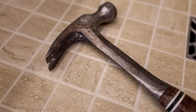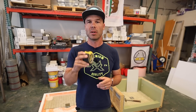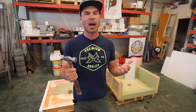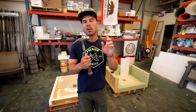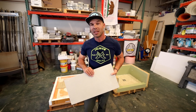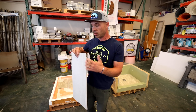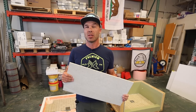I'm going to be doing drop testing on the foam pan and the mud pan. First, I want to test dropping a heavy tape measure — a 25 or 30 footer is pretty heavy and can pack a punch. Next is a hammer. It may not be the most realistic scenario, but maybe you had one to break a tile out on the wall. Lastly, and probably the biggest threat, is a 12 by 24 porcelain tile — about 10 pounds, since porcelain goes about five pounds per square foot and this is two square feet. It's very plausible someone could be setting a 12 by 24 on the wall, it slips, and drops on the pan.